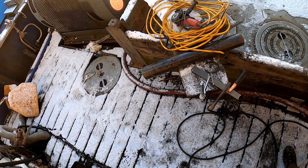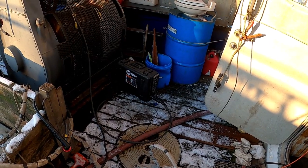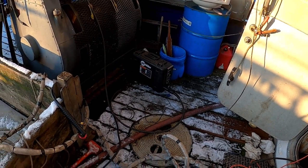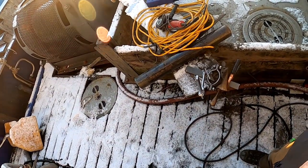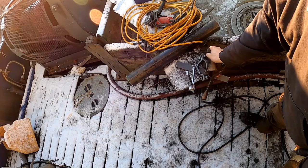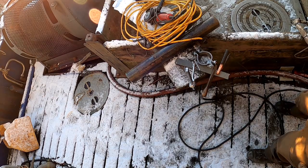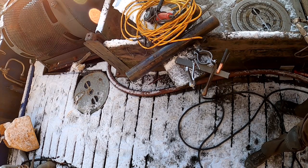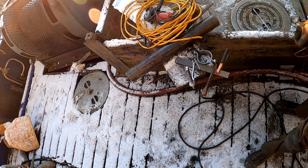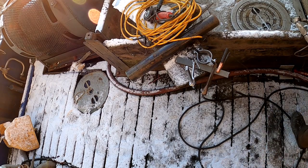And I guess now is also a good time to give a little rundown of the equipment I'm using. Using an XMT 304 hooked up to that 12VS suitcase over there when I do wire feed. And I'm running Washington Alloy, I believe it's the ER71T-GS gasless flux core MIG wire. Good for stuff like this, single pass. It's not really rated for material much thicker than 3/16. Of course, this is about quarter and 3/16 on the clamp, but works really well. Not a multi-pass wire. That's why I've been stick welding the pipe, but overall pretty darn happy with it. Just makes stuff like this so much easier. Just jump on the wire feeder.